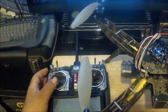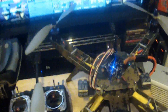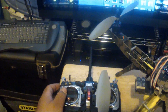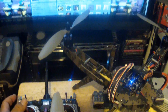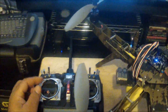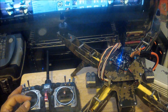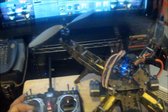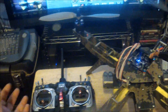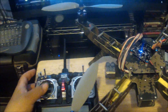Just to check that everything is working: this particular board needs to be armed and disarmed — you can't just plug the battery and go. Every time you want to fly, move the stick up then left and right; you'll see the light flash twice. Then move it down and to the right and it should be getting power — and it's very responsive. To disarm it, just move it to the left; you'll see the light flash again and there's no throttle action.